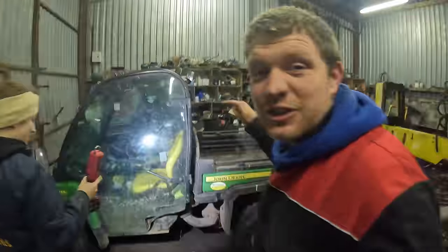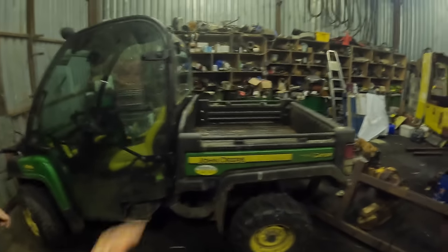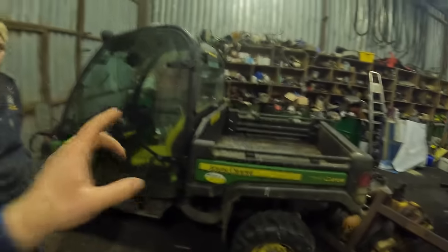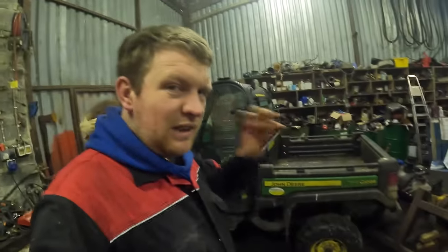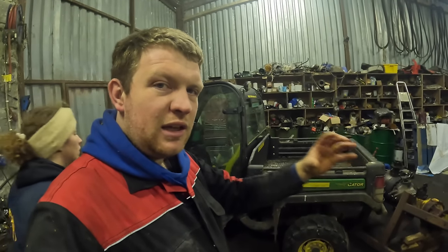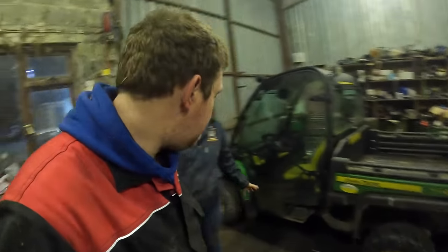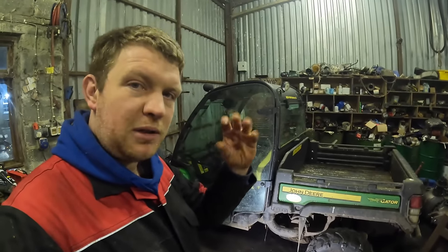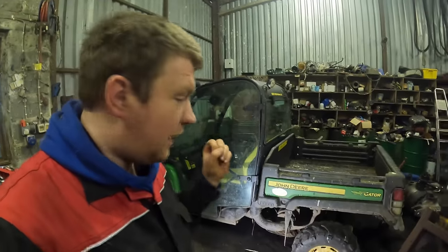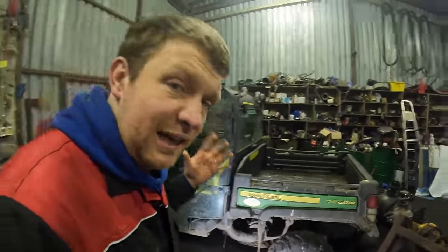And we are going to do the belt in the gator and service it. So our belt has gone, so that's what drives it. I think it's called a CVT. It works on a belt and then a pulley and another pulley, the pulley from the engine and the pulley going to the wheels or to the gearbox. What happens then is one pulley gets a bit smaller while the other pulley gets bigger, and that increases the drive going to the back wheels, makes it go faster. That's how it works. But her belt has broken and the gator hasn't been used in quite a while, Liv.